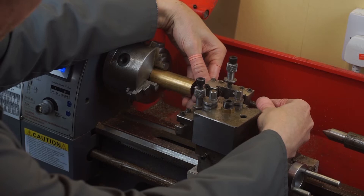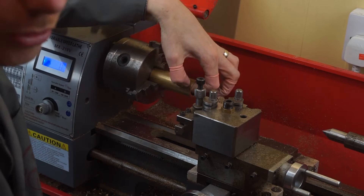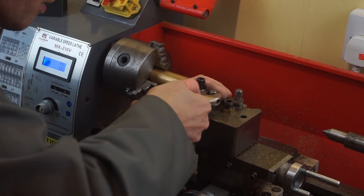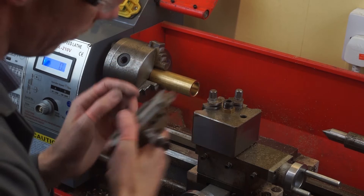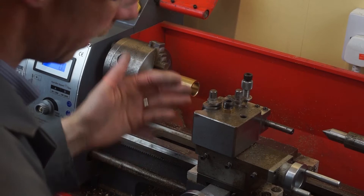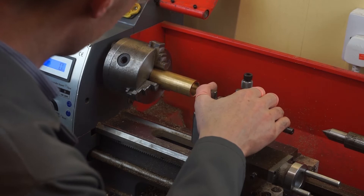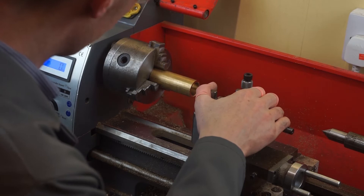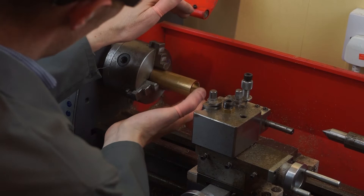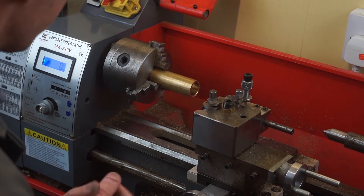This tool here will go into the metal inside the hole and it will actually allow me to make fine adjustments to the internal diameter. I'm just going to remove the parting tool — that's the part we use to take the movement ring off — and put the boring tool on the back here. The great thing about these quick tool posts is that you can just quickly change over your tooling. One of the main principles of lathe work is that everything has to be completely rigid — the material, the stock, everything has to be rigid at this end. You don't want too long a piece of material in the chuck, and everything on the cross slide has to be rigid too. I have this machine specifically set up just for this task.